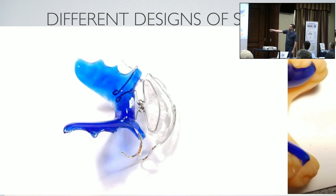This is a different design — it's got helicals, so it's got built-in slack. If you take a wire this long and try to bend it over, it's hard. But if you put coils in it to give it more length, it becomes easier to bend. This would be used for cases where there are 3 or 4 millimeters of movement needed.